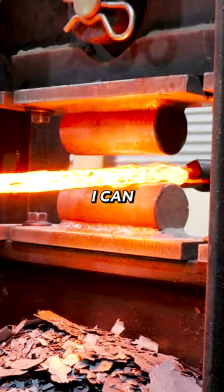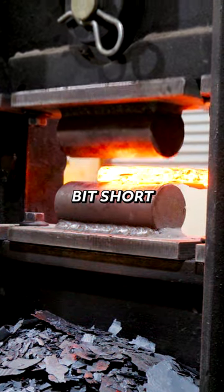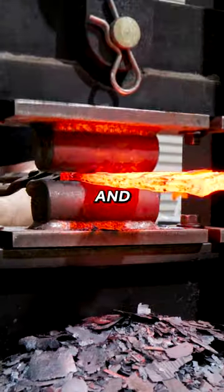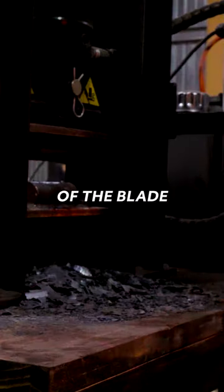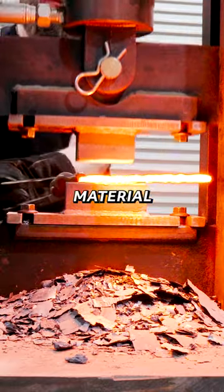With the tang set I can switch over to the round drawing dies and start making this one longer. My heel is just a little bit short, but if I change my approach angle and start pulling down right on that corner on the edge of the die, this one should be no problem at all — and that's looking tall enough. So now I can just start pulling out the blade. I need just a little bit more height in the center of the blade so I'll apply the same principle and keep moving along the cutting edge, trying to pull that material down.